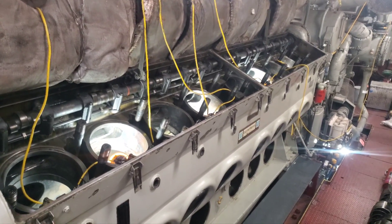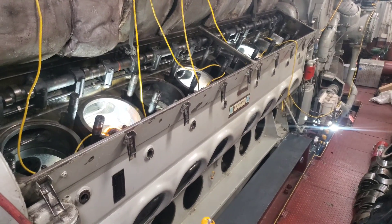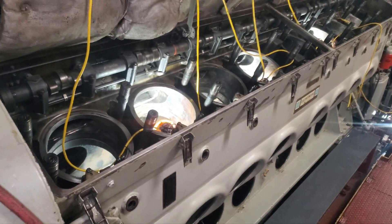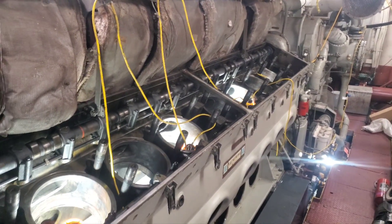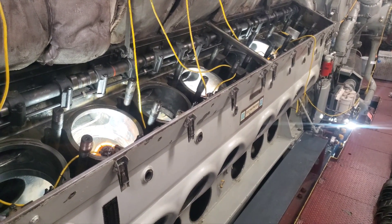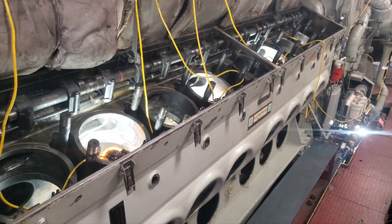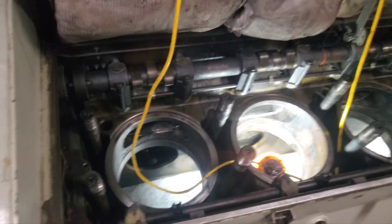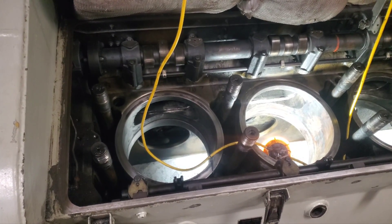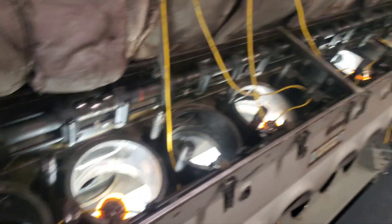Hello again everyone — we got a little bit of action on the last video about these EMDs, so I figured I'd bring you back and show you more about what the insides of these look like. These engines are going through a 30,000 hour overhaul. This one has about 80,000 hours total. The other one I'll show you later was just over 100,000 hours. Right now the power packs — which is the cylinder, piston, head, and all the top end, the injector valve train assembly — they're all removed.